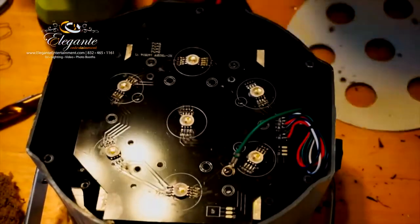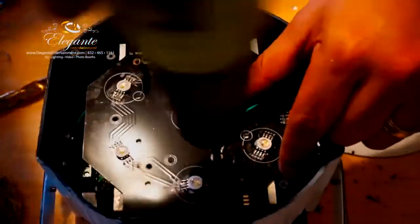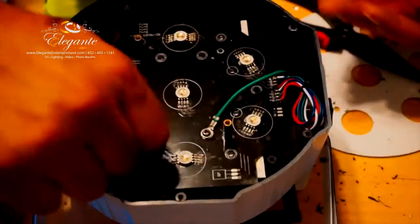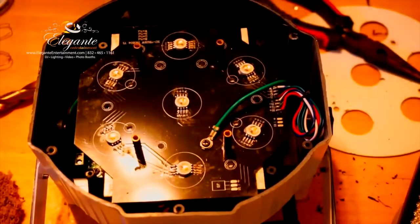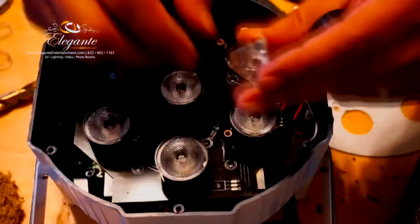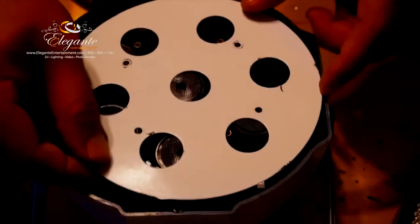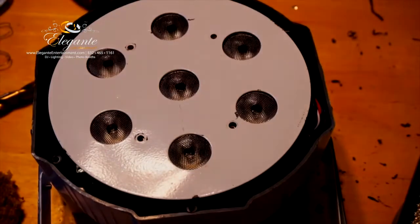Now we do the LED board to the heat sink, then the standoffs - starting with the ground. Double-checking because I didn't remember where the hole for the ground was, but it's right next to it. We put in four standoff holes - I had it too tight so I had to loosen it up to get the other standoffs in. Now we put in the lenses - it's pretty simple: the black piece goes down, then the clear magnifier piece goes into it and stays by force. It then gets secured with the metal plate and four screws.